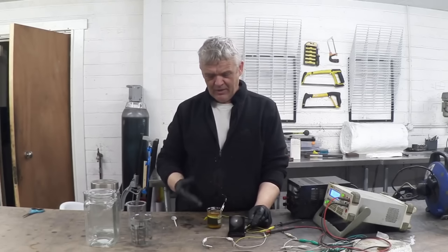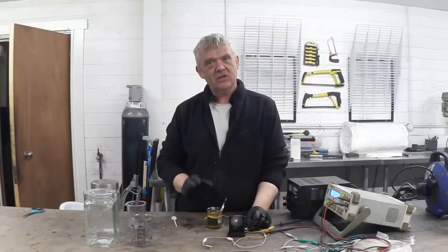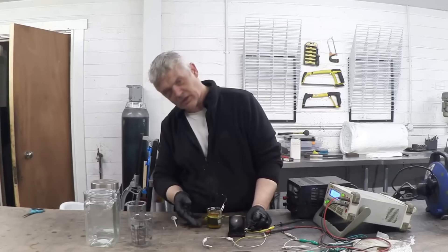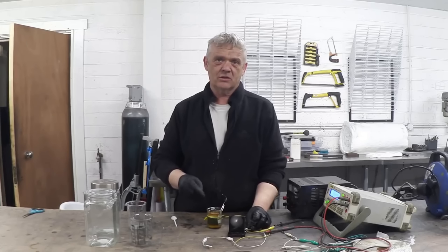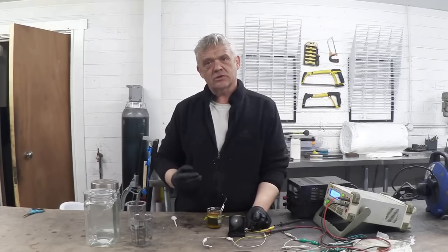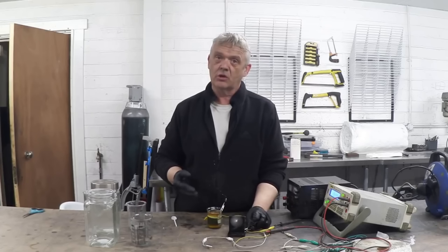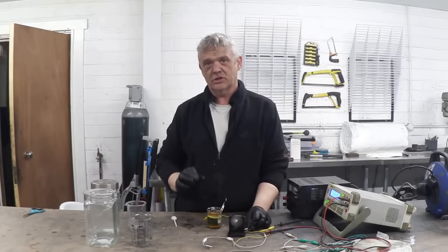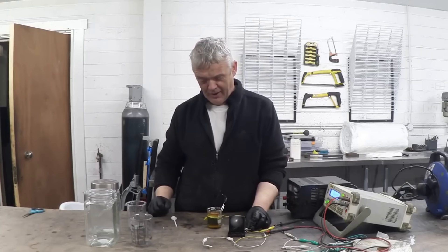This battery is really quite awesome. The layer of oil captures any bromine that might come off, and it also captures any hydrogen — this does off-gas a little at the high charge voltage, but at the correct voltage it doesn't off-gas much and you get a nice banded separation between the bromine and the zinc bromide solution. The hydrogen gets captured long enough for zinc oxide in the solution to form zinc hydroxide, which is very cool. As it charges the zinc bromide concentration reduces and resistivity goes up, so it's a good idea to add an assistant salt: sodium bromide works really well. Five moles of zinc bromide and one mole of sodium bromide keeps enough ionic concentration that the series resistance doesn't go too high.